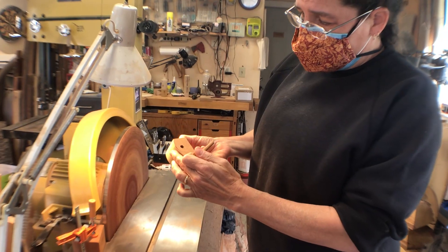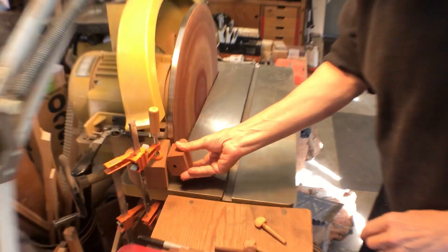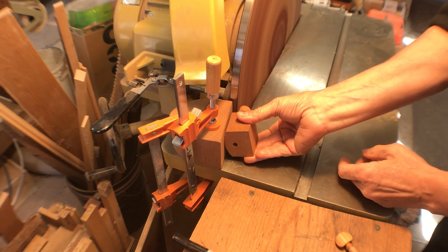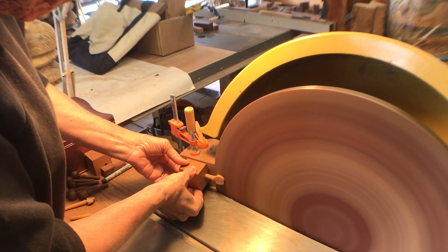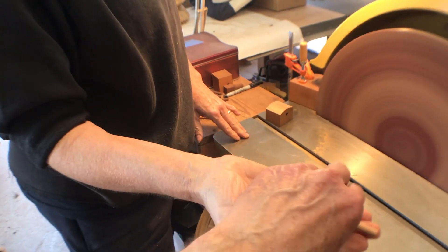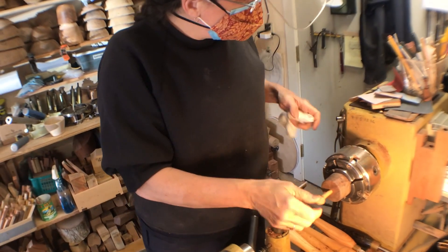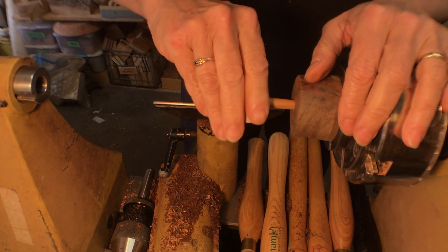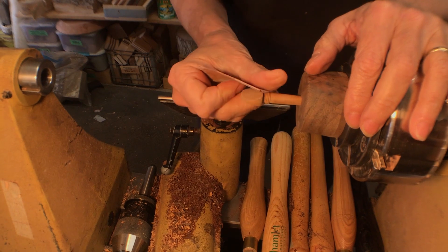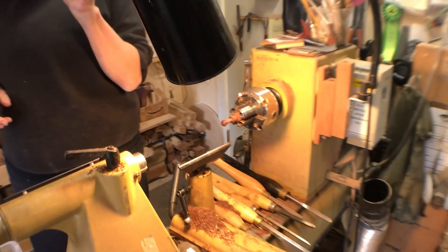These are cheap tools — my favorite kind. It has a reamed hole in it and an arc stick, and there's a block that it rides against. You just rock it, rock it, rock it until this block comes up to a little line. This makes it a whole lot easier because it's held securely — it makes it very easy to do a nice consistent bevel around the edge of the head. And you've got some wax for me, right?